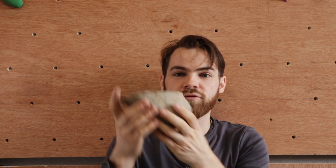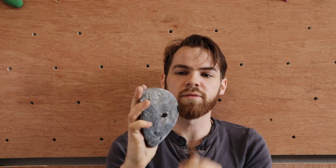The next question is how you actually form the climbing holds. I started with open sand casting — a bed of sand where I impressed and scooped out a shape. That works really well for smooth shapes, and you can get a bit of overhang to make something more positive. I was targeting a 20-degree overhang, so something really positive, but still non-trivial to climb. It's quite slightly unpredictable though — one came out quite uneven and much less positive than intended. It's a technique that takes a bit of getting used to.